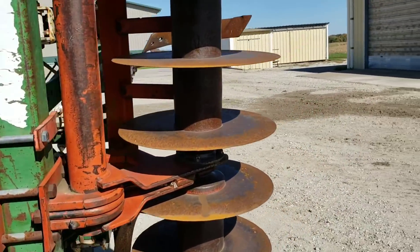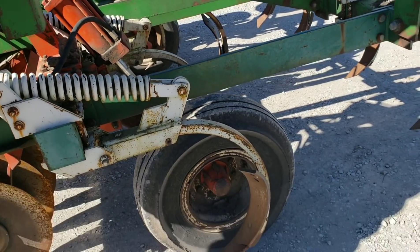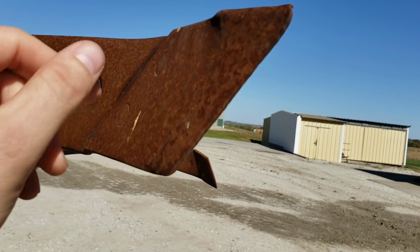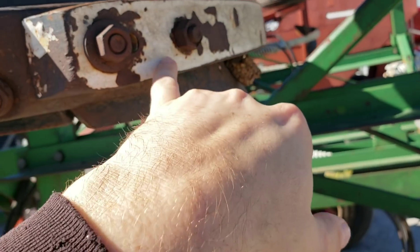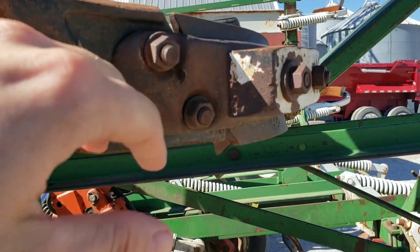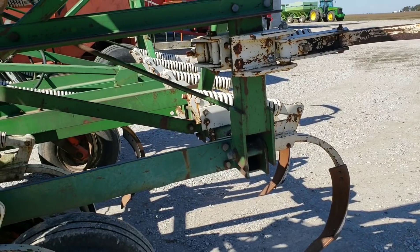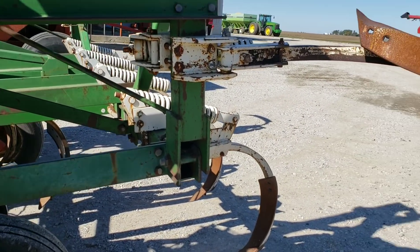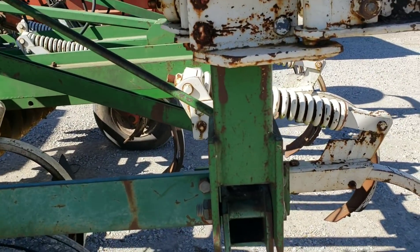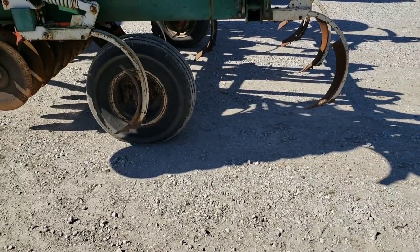This particular machine is equipped with spring-loaded shanks — they also had a standard mount shank option. These are a four-inch wide twist lay. There's the twist lay and the front piece is called a frog. This was a Glencoe exclusive and I believe the bolt pattern is the same as a John Deere, so you can buy this chunk, the frog, and the four-inch Glencoe twist lay for a John Deere. Your frogs are going to be your most wear-prone item, and you can see how these twist one way and then the other — it's a layover lay-back. We'll go out, drop her in the ground, and I'll explain more about my thoughts on tillage and this particular machine.